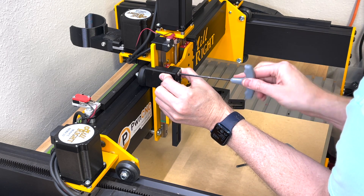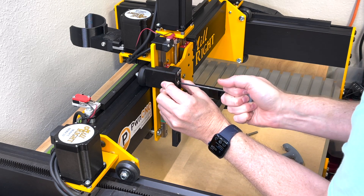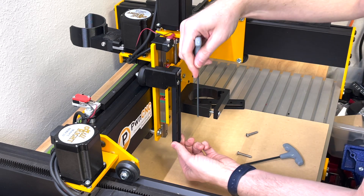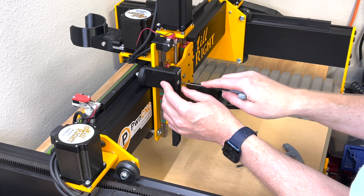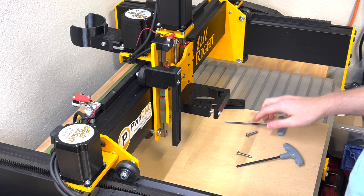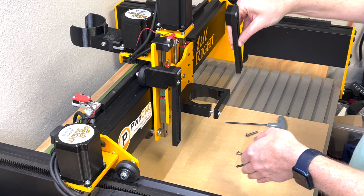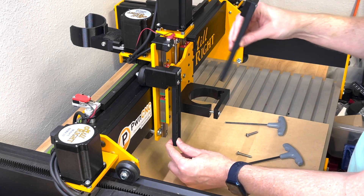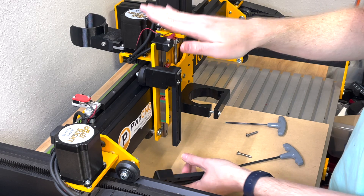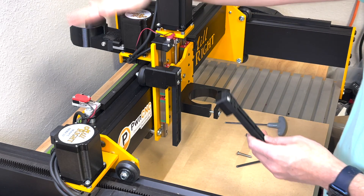Give it just a nice taut turn. It shouldn't wiggle too much side to side, and front to back it should be exceedingly solid. Once the boot is in place in the arms, locking pins will help hold everything together, especially limiting side-to-side wiggle. Front-to-back wiggle is what we really don't want, because that's where the hose comes down into the boot — there's pressure on the back side, and the assembly needs to hold the weight of that hose.